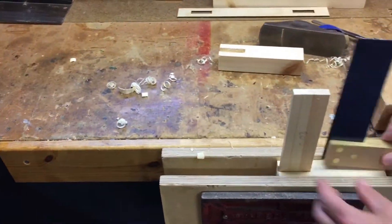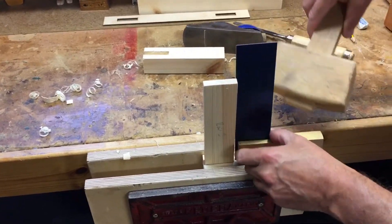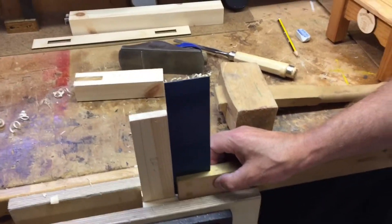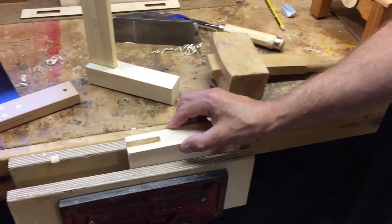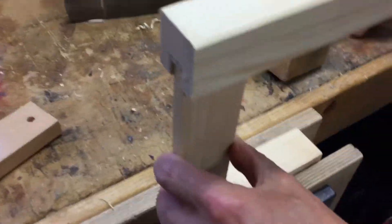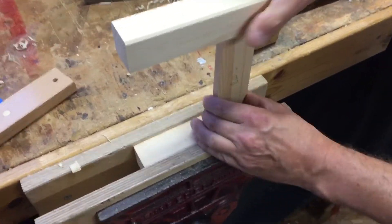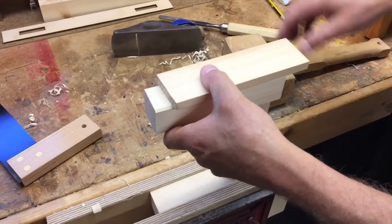Let's put it together. There's our leg, there's our rail. Don't go mad — if you're worried about the wood splitting, it can split. The first time it should be a tight joint. Nice and vertical. Get a little tri-square or large tri-square and make sure it's level. It's slightly out — that's the purpose of the tri-square, to check everything. Would it be more accurate to use a bigger tri-square? Yes, definitely. Jake, I think you should put the wood down a little lower, otherwise it may split.